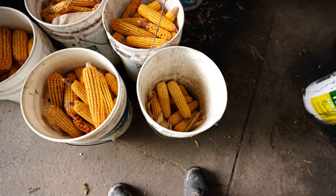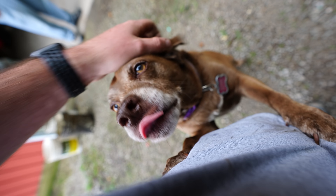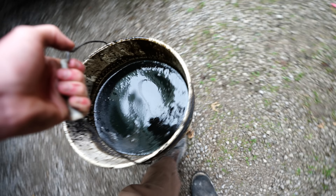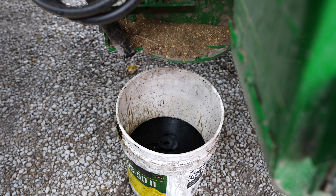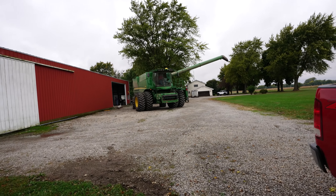The new combine has 70 hours on it. You're supposed to change the break-in oil right around 100, but we're going to go ahead and do it now because we have a window with the weather delay. There's no rain here and it looks like we may have 45 minutes to an hour to squeeze this in — enough time to dump that oil out and put new oil in. There's no break-in period for hydraulic oil; they change the entire system when they replace motors and pumps. At 44 quarts — when it gets to more like 45 or 46, the new oil is pretty much full. We're going to start the combine and make sure there's no leaks. She's got the green light to run another couple hundred hours.